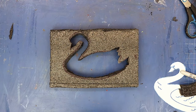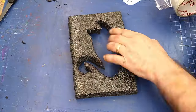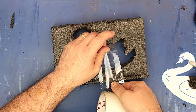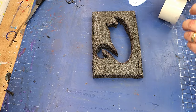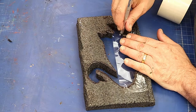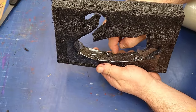I've cut all that out and this time I'm going to try something a little different. Normally I cast straight into this as it is — I put it on a base and cast it, and it gives a textured effect that I then have to sand off. So this time I'm going to cover the inside with some clear sticky tape, without stretching it or pushing it out of shape, to try and get a much smoother result. That should avoid all these little bobbly bits.